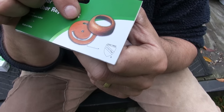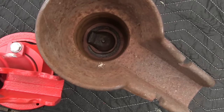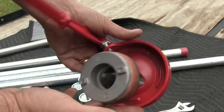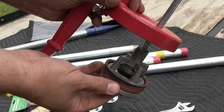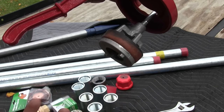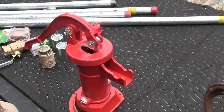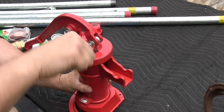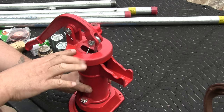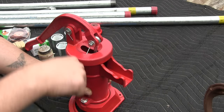Looking inside this new pump you can see the weight sitting on a leather check valve just like the old style pump. On a brand new pump the operation is the same — there's the weight that lifts up to let water pass by, here's the leather plunger that sucks the water up, and the new pump has the same leather check valve in the bottom with a little weight on top. The technology is exactly the same. Now a lot of people asked about priming a well. What the pump needs to operate is water inside of it — you take a gallon jug and fill the inside of the pump, then generally give it 15 minutes so the leathers can soak up the water and swell.